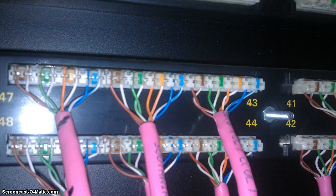I want to talk about the way that you should trim the cable jacket on a Category 5 or Category 6 cable right before you terminate it onto either a patch panel or to a jack. The simple explanation is the goal is to have the least amount of exposed wire — the brown, green, orange, blue — the least amount of that should be exposed between where the jacket ends and where the termination occurs.